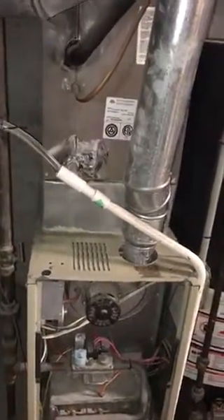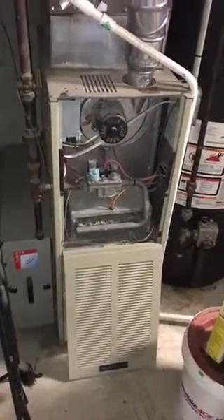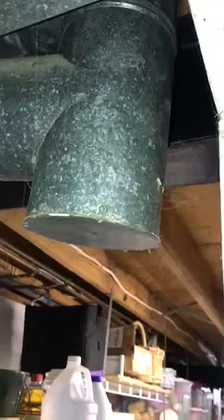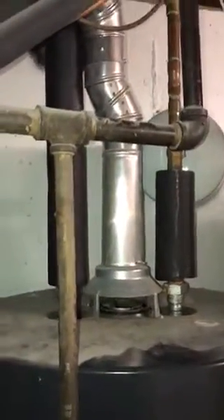That's a 16-inch wide coil on the furnace, so we're going to go back with an 80% furnace. One of the things you'll notice that's a little bit of a problem — let's look at the flue pipe. The flue pipe goes up here, you've got a clean-out and a tee, and actually if you look up there, there's the other tee for the hot water. On the hot water flue, you've got the thin aluminum pipe that needs to be changed out.